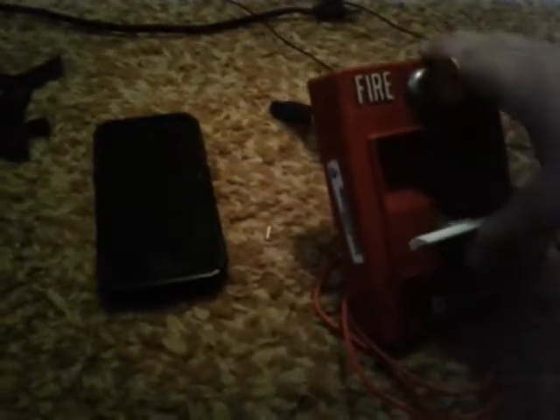First, pull it. You need a Simplex key by the way — you can't push it back up or else you break it. So if it's a pull station like mine, the newer Simplex T-bars: first you turn it left 180 degrees, then you open it — see the handle springs back up — then you close it, and then lock it one more time.